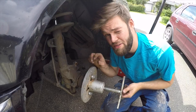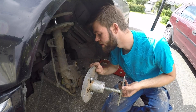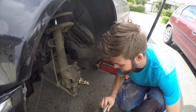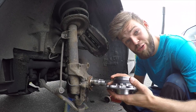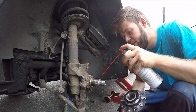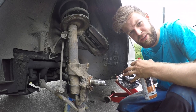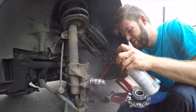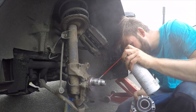Turning the tool around, the bearing starts to come out. What I actually did was heat up the bearing with a hairdryer so the metal gets much hotter than the axle. Then I spray the axle with cold spray so it gets cold and shrinks. When the bearing is hot it expands, which makes it much easier to get the bearing on and off.